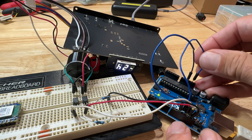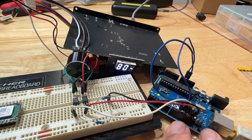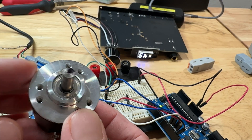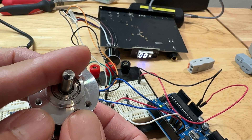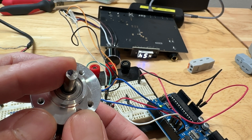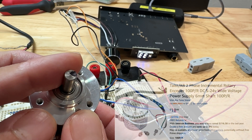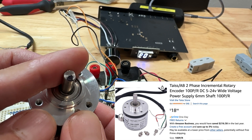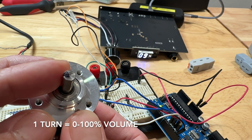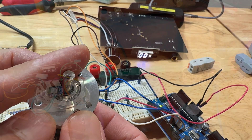As you can see I can now raise and lower the volume using the Arduino. Once I had that working I added an encoder and programmed the Arduino to read the encoder and send that encoder signal to the DAC. I knew an encoder would be tough for an Arduino to read because it's switching at such a high frequency, so I picked an encoder with a low line count. This one is 100 pulses per rev and the DAC is also 100 pulses from min to max. This all seems to be working well so let's get the wireless part working.